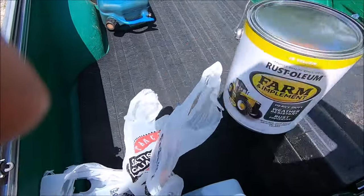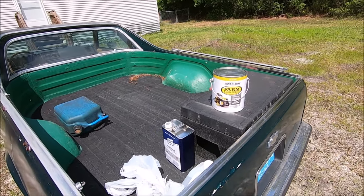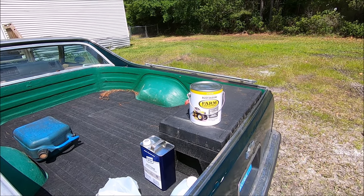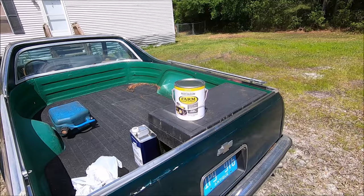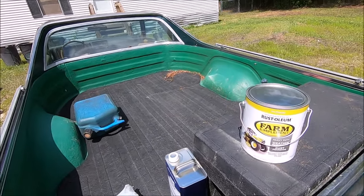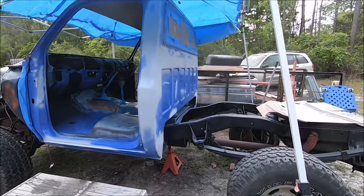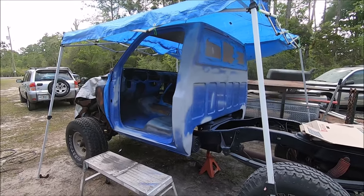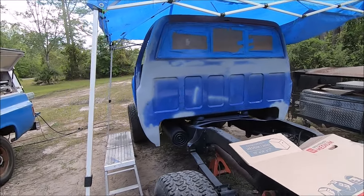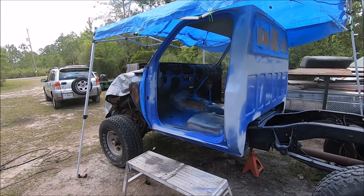Paint flavor of the day is farm implement paint — we're doing that because I'm poor. This stuff is $75 at Tractor Supply and it's yellow. It's fairly resistant paint, and the good thing is John Deere yellow is available pretty much anywhere. You can get touch-up spray cans easily from pretty much anywhere. This stuff you thin with mineral spirits. I've wiped and wiped and wiped until my cloth came up clean, so I think we are ready to lay down a coat of paint once the remaining moisture dries from my damp cloth. Here goes nothing.